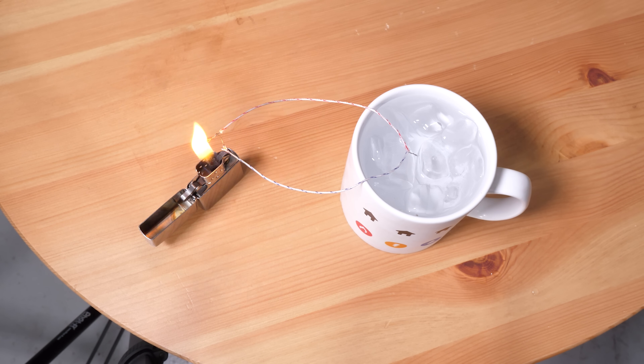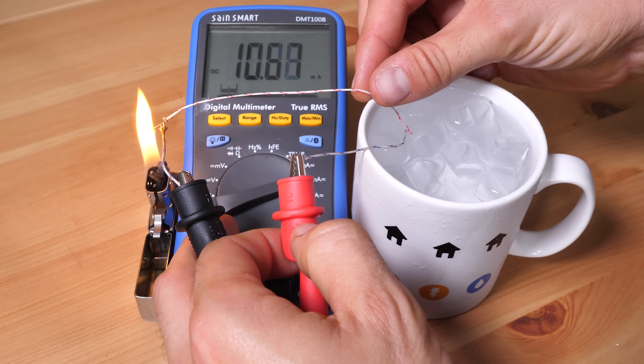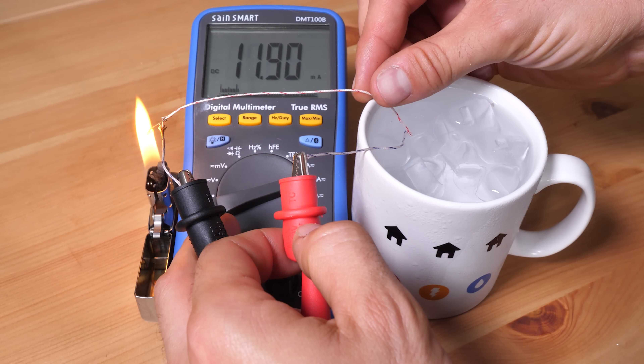Remarkably, when you have two different wires made of two different metals joined in this way and you heat one of the junctions while cooling the other, electricity will go round and round and round. It's an incredible effect that turns out to be incredibly useful, especially when you consider the fact that it's reversible. We're using a difference in temperature to create a voltage, but the opposite is also true — if you apply a voltage, it creates a difference in temperature. Those two phenomena together are known as the thermoelectric effect. Specifically, when a difference in temperature creates a voltage, that's called the Seebeck effect.